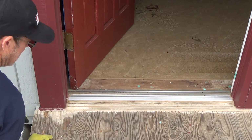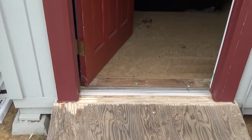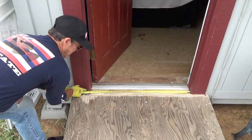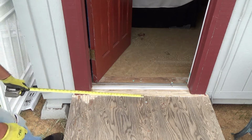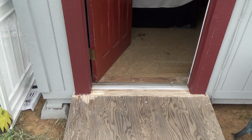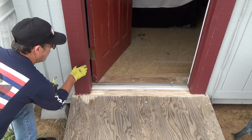That's in line with that, because the door is 36 inches. Let's get you back a little bit. The door is 36 inches wide, the steel door. And this is 36 inches wide. In fact, it's just a hair less than 36 by 1/16. Okay, so we want the screen to fit as centered as possible between that. Okay, so then we've got a slight gap from that before the stile.